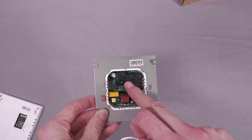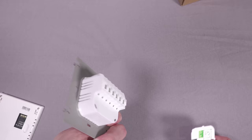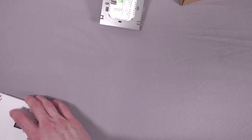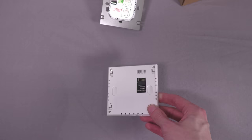Other than that it's a fairly neat design. You've got three relays in there — five-volt relays rated at 10 amps, so decently specced, especially if you're switching lights. In the UK this is on a six-amp circuit so that's more than enough. That clips back in and then we've got the screen itself on the front with the connector on the back.